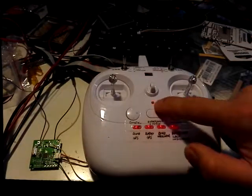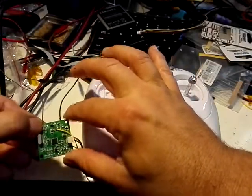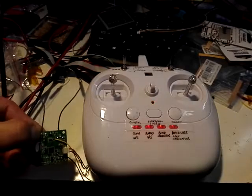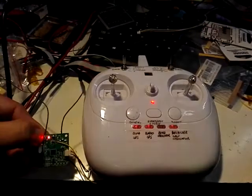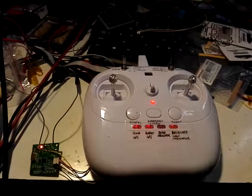When you're bound, this light will go solid on. Now on the receiver, hold this little button on the side — your bind button — while it's powered off, then power it up. At this point this light will go solid, this light will go solid. The bind process is now complete.